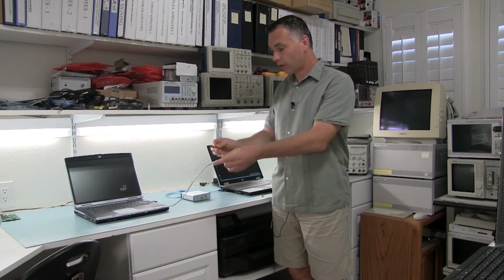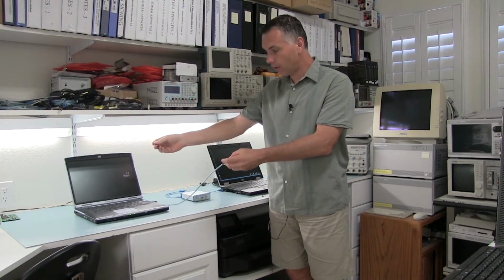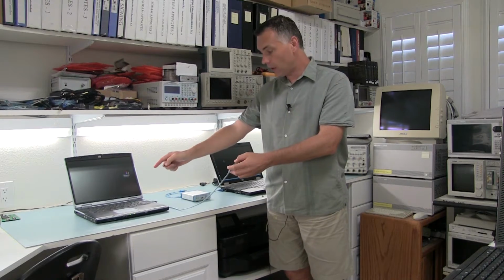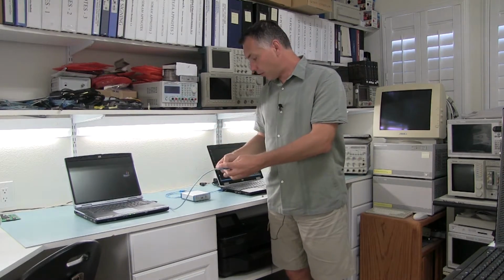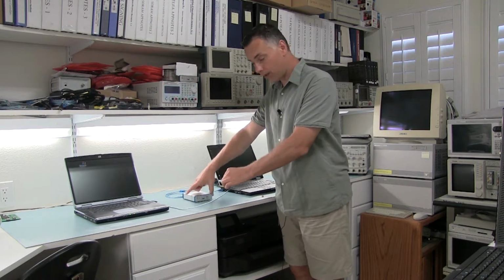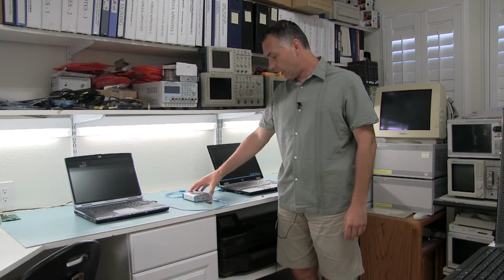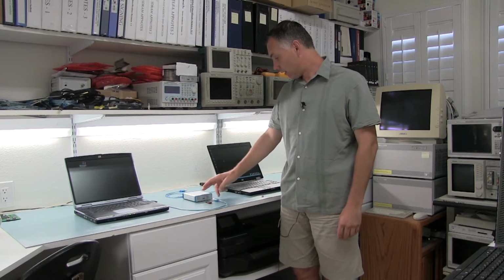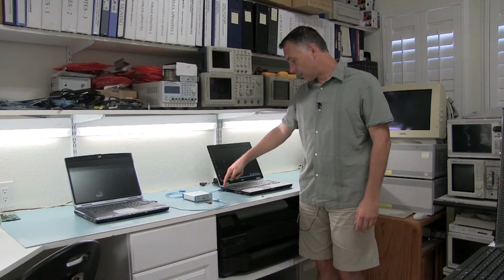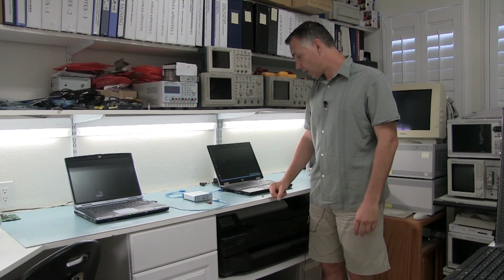Normally you would connect, for instance, a USB key directly into the host controller port of the host computer. But now, since we want to capture the data, we connect the USB analyzer in between instead, like this. The data will be captured by the 1480A, and we have a second analysis PC that will run the software that will display the captured data. So let's see how that works out.